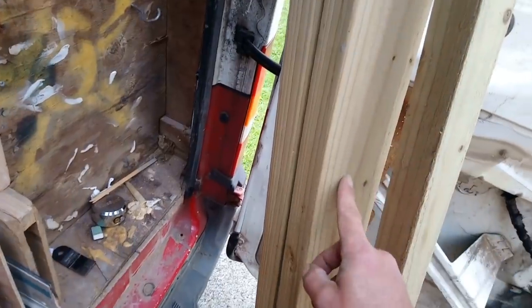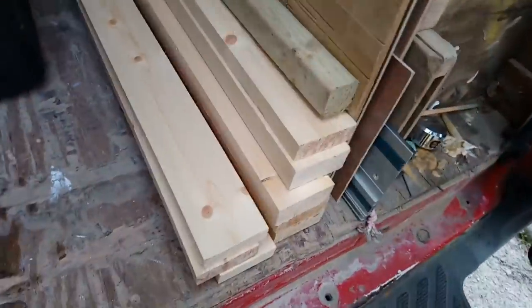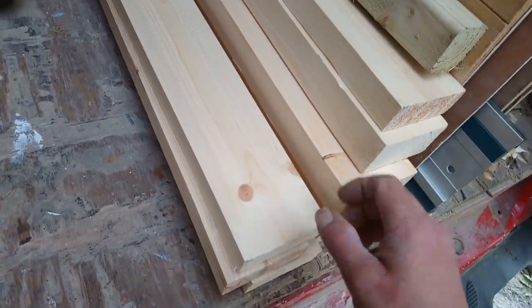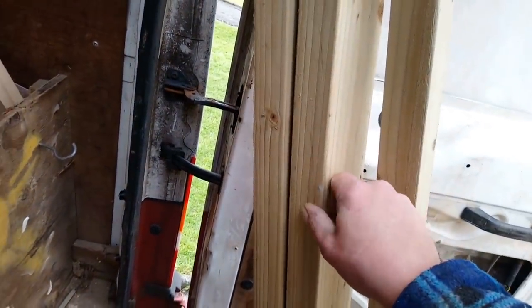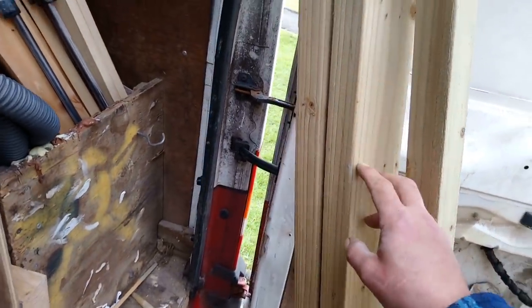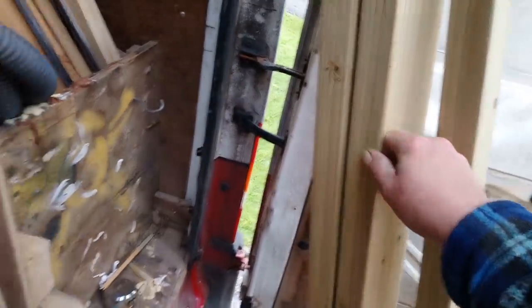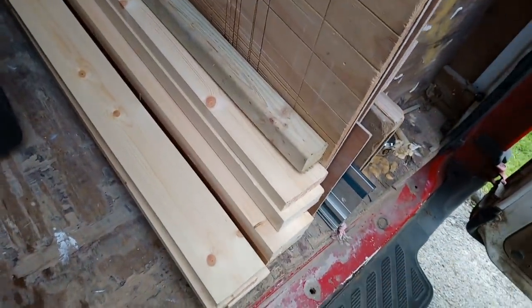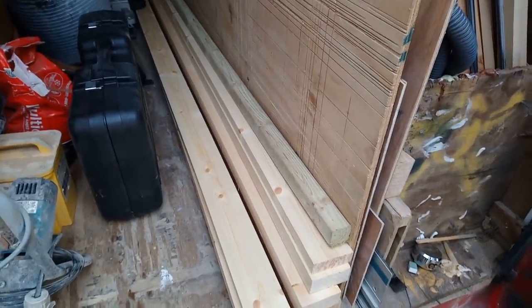And I could make the gates out of this stuff. But I need 1.5 inches for the rails, see there, so the matchboard goes on so they come up to the same thickness as the stiles that are going to go down and the header. And it's a little bit soft, and with the amount of cuts that I'm going to make in a gate, that's where it rots, on the joints. It's not worth it because that costs more than the PSE stuff, plain square edge. So the doors I'm just going to blather with clear treatment and they're going to get painted anyway.